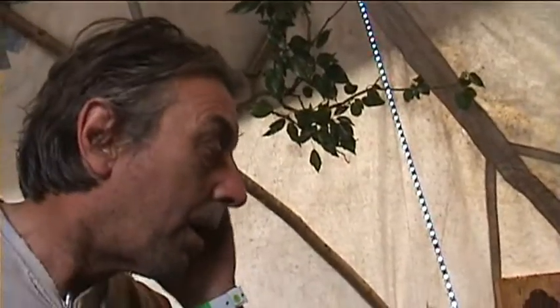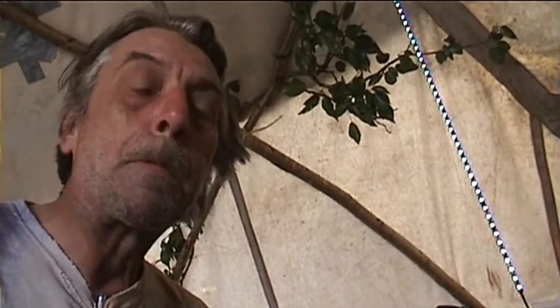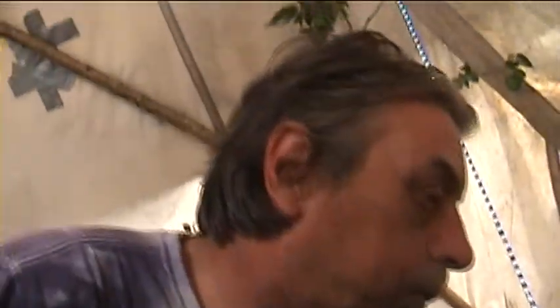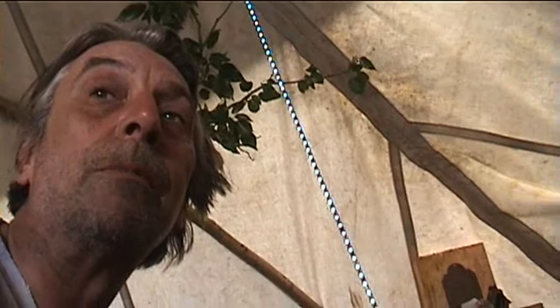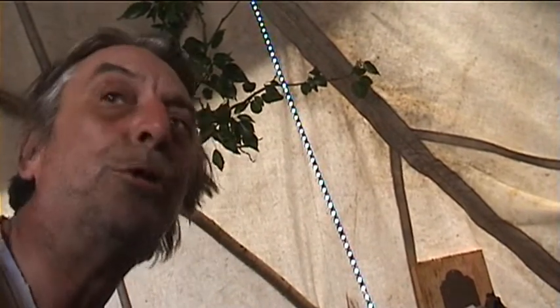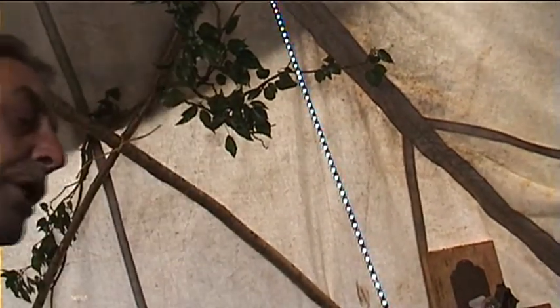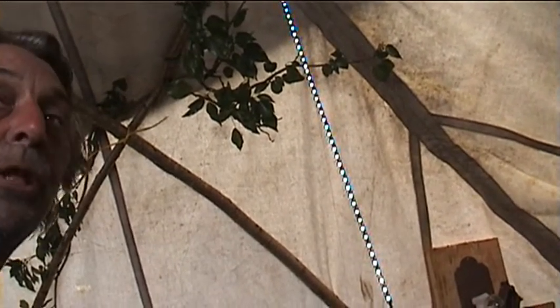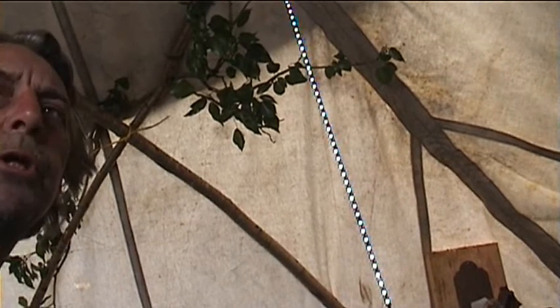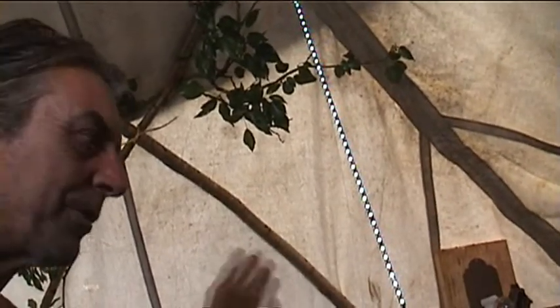So how much is a unit like that going to cost? To retail, about £450. And how much could somebody make it for themselves? Probably about the same, because of all the work that you need to do. There are parts of it that you can't easily do yourself — if you need to machine a plate to within a thousandth of an inch, and get the surface finish to within 23 micro inches — 23 millionths of an inch — that's the level of precision required.